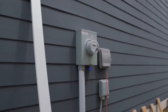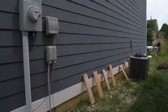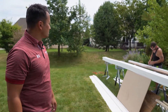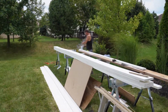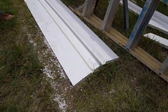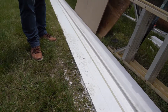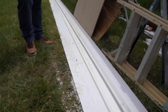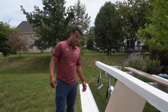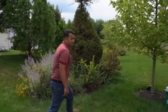It pairs really nicely with the fiber cement siding because it has the same texture. Cutting Versatex is pretty easy — you can see the shavings here. What's happening is they had to take some material out and router through this board so it can accept the soffit.